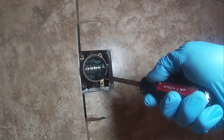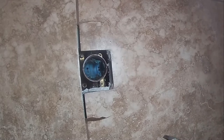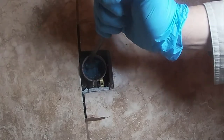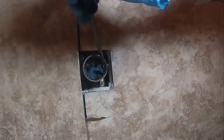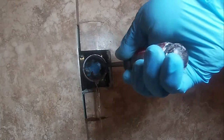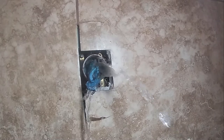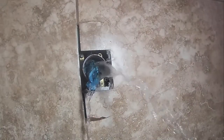Once you break at least one side off, get your screwdriver underneath the cylinder and pry it out just like I did. Once the cylinder is out, you are literally almost done. At that point you can go from the bottom or from the top and pry the whole piece out. You can see the plastic is very soft, so it makes it a lot easier to just crumble it and pull the little pieces out one at a time. There's really not much holding it in there — it's all the calcium buildup over the years that makes the cartridge get stuck in there really bad.